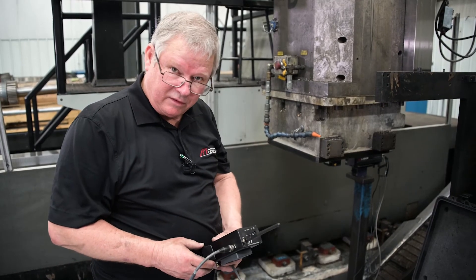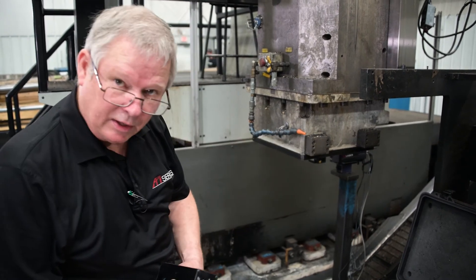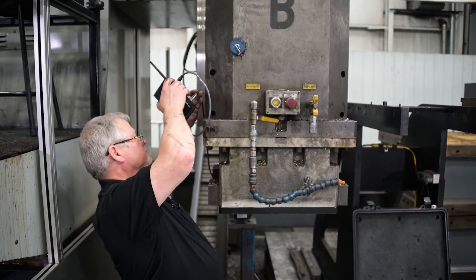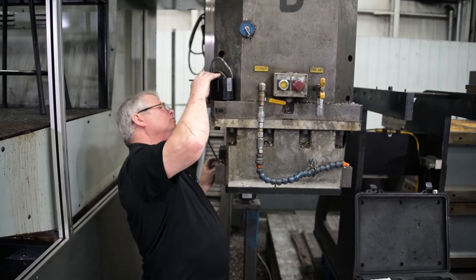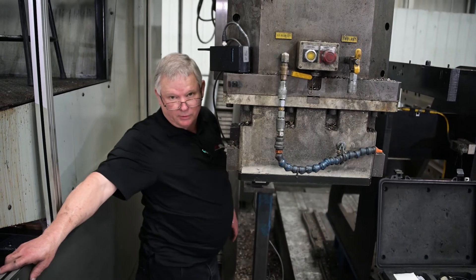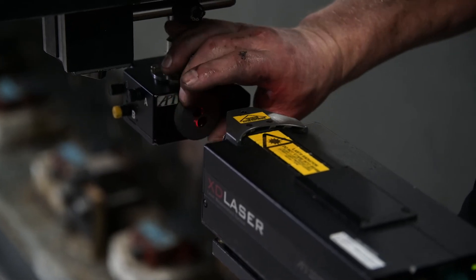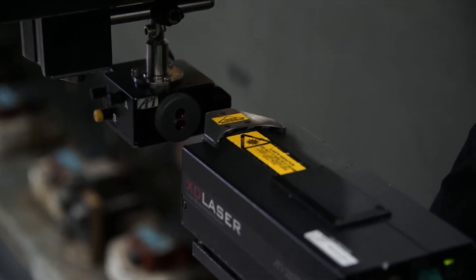What I have here is a communication device that communicates wirelessly between our sensor and the XD laser. I'm going to hook this up, turn it on, and we'll be able to see the communication between the XD sensor and the laptop. On the front of our sensor where we aligned to the mirror, we're now going to turn that mirror out of position and open it up to the holes on the opposite side of the sensor. Now you have the laser beam traveling through the sensor, coming out the top hole and back into the top hole of the XD laser.